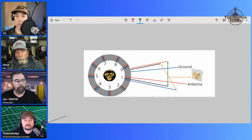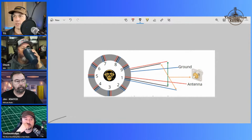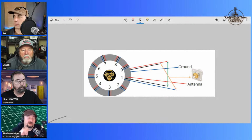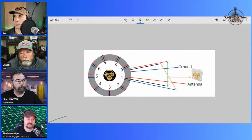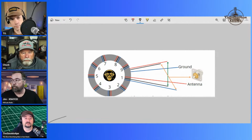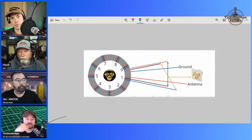I'm asking this question because I literally don't know the answer. Could I just do one wire, 27 wraps around the toroid instead of 3 wires? If you're good, but you're going to have to tap it to get it to ground, right? And there's not some mutual strange inductance going on because of the 3, like you're not getting an amplification as well? No. Our friend Matt Hare, when he was on somebody's channel, I can't remember who it was, it might have been ours, he says that he winds his with a single piece of wire and just makes the adjustments accordingly, and he claims that it's easier, and it might be, I don't know. I've always done it this way, and I've never had any problem. And I've built dozens of these things, and it works.